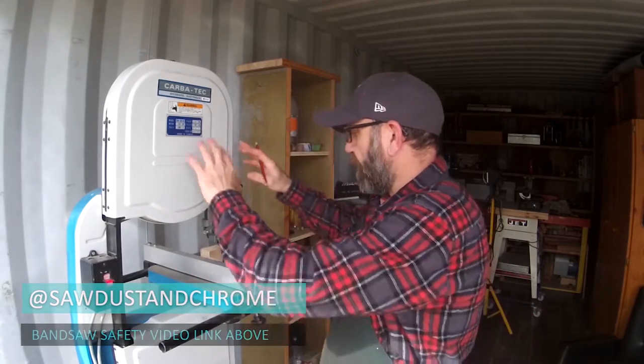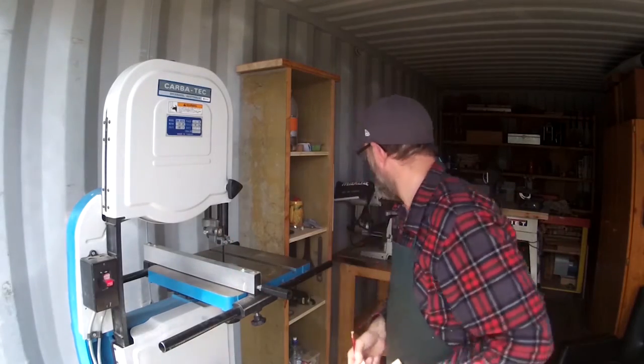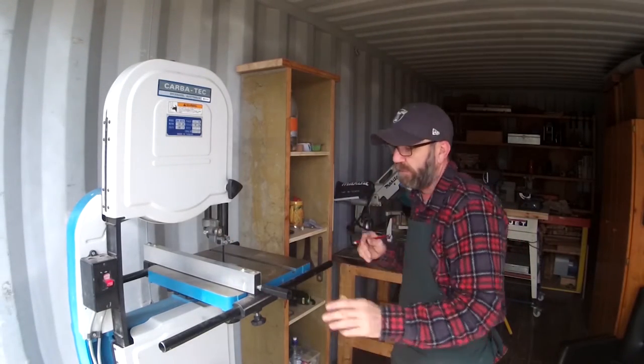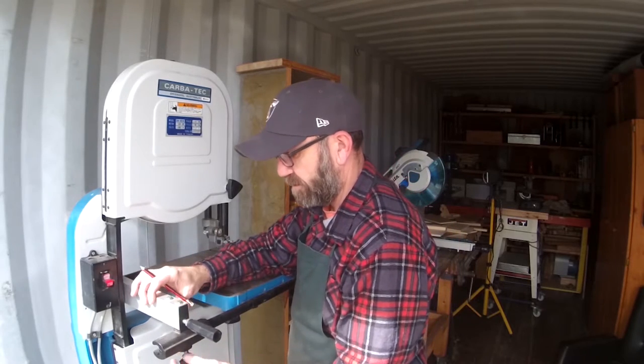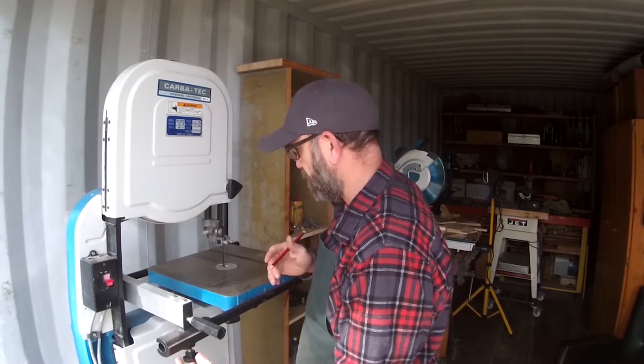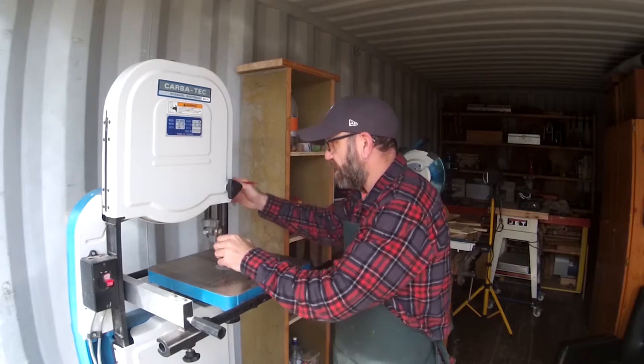Again, obviously, we don't want to damage anything that we can't grow back. So please look after yourselves. Bandsaw, first thing is get rid of what we don't need. So I don't need my slide today. Fence I can get out of the way, because we're not really using that today either. And most important, make sure you lower the guard here.